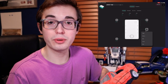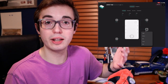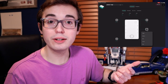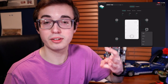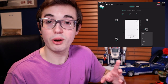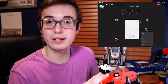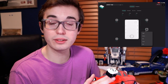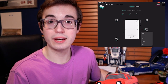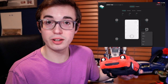That's the simple color mode. But if you notice at the bottom of this dropdown menu, there are three more options that are color related: red, green, and blue. These are raw sensor intensity values for each of those three colors. Red, green, and blue are the three primary fundamental colors for optics — the human eye has three color receptors for these. That's why LED TVs are able to make every color imaginable with just three colors in their pixels. The sensor can't detect colors like yellow directly, but instead it measures the relative intensities of red, green, and blue. If there's a high intensity of both red and green, for example, it knows that color is yellow.